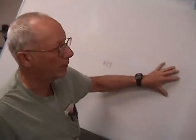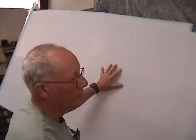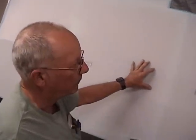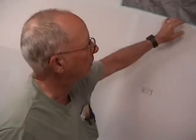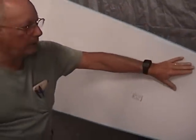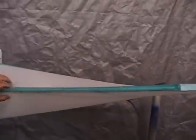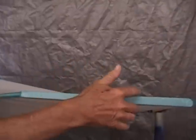Now we have the final piece of fabric on the airplane. We've done the bottom, the two sides, the fins, and now the top is in place. It's been brought up to the full 350 degree shrink. What's left to do is to go ahead and do all the finishing tapes — tapes over the areas where the tubing can contact the fabric. I need to put our tape down this leading edge. Normally I would go ahead and apply this tape here first, but for time constraints I'm going to apply this and leave it loose on this end so I can lay that tape and tie them together.